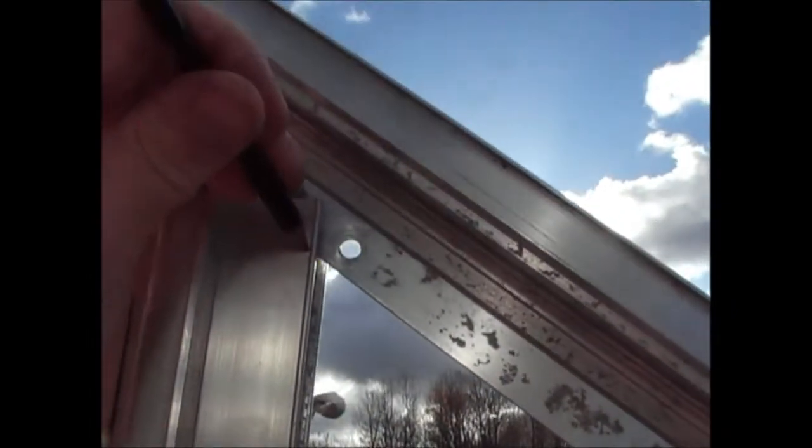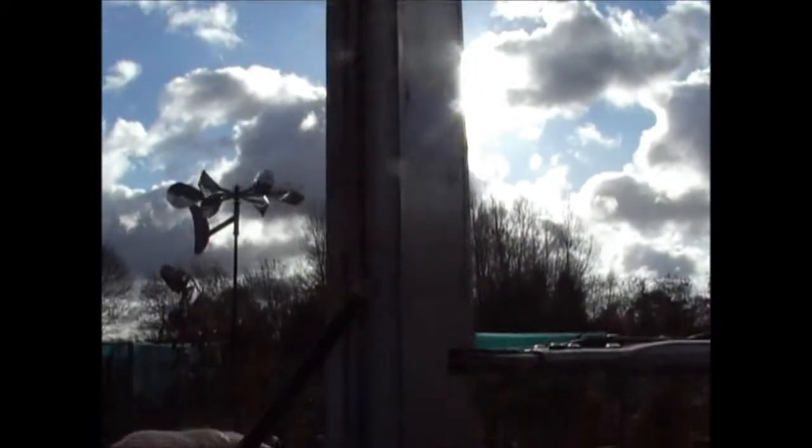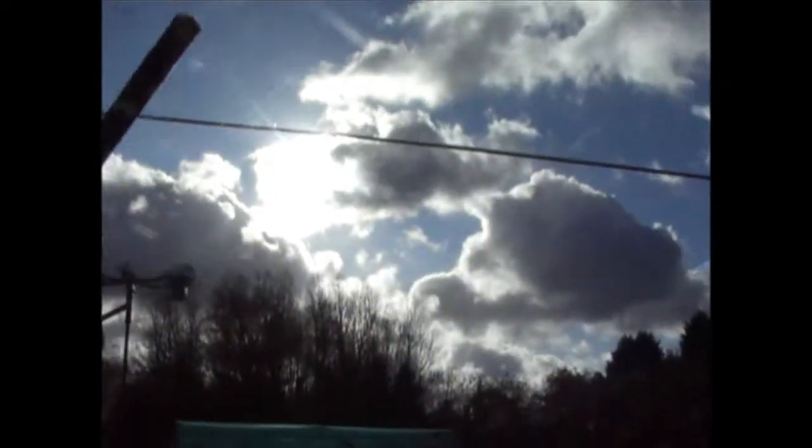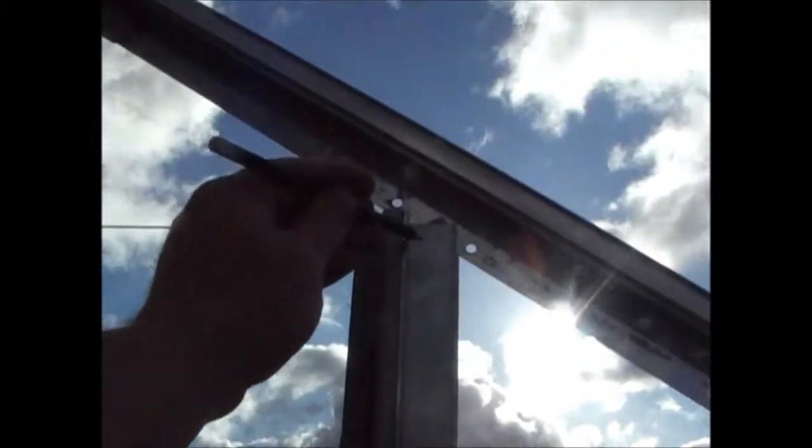Likewise on this side I just need to eye up like that. I need to cut out that section there so again it'll sit flat on the frame. What it needs to do is just make sure you've got the line going all the way down like that, and if anything what you want to do is give yourself a bit of give. Don't make it that tight that there's almost no tolerance in it, because the glass should be able to freely move backwards and forwards like that so you don't snag anything. So as soon as you've got those two measurements you can take this back out. It's quite a windy day today. So I'm going to cut those off, drill the holes - one at the bottom, one in the middle, and then one at the top - same on this side. And then put all the glass together, obviously the middle two that are missing at the moment in as well, put it in the frame and then with the bolts bolt it in.